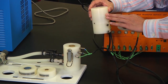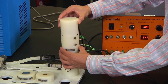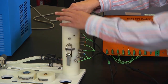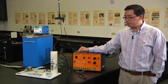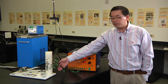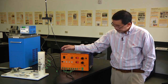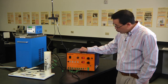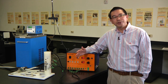On the top layer we're going to have a constant heat transfer rate. Let's sandwich the sample now — you just clamp it, and also on the back side. So now this first sample is already sandwiched between the constant heat transfer layer and the constant temperature layer. Now we need to give some input to the electrical heater. The unit is already turned on, so now we need to set up the voltage. Remember, you need to refer to the menu for your group.